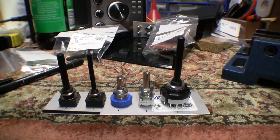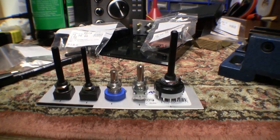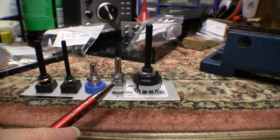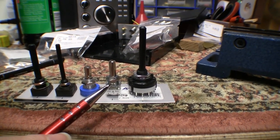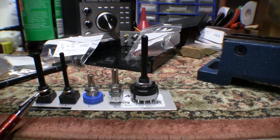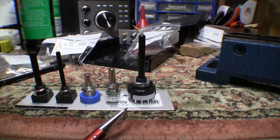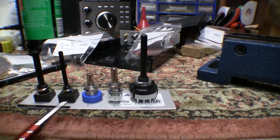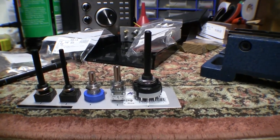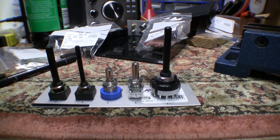Finding all the controls and the selector switch turned out to be just a little bit of a challenge, because this here is like a 1K log pot. You'd be surprised how hard it is to find a 1K pot these days that you can panel mount. And this is a 1K linear, 47K LIN and 10K LIN, so I'm just laying them out to see if I equally space them, will they fit okay, what's it all going to look like when it's done up — but I think we're good. They look reasonably equally spread across the front.